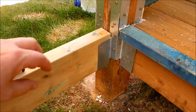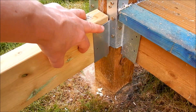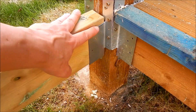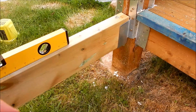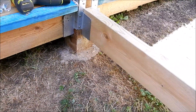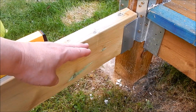You might think five-by-two is a little excessive, but what I really wanted is for it to sit above the holder so I can put timbers across. I didn't want to cut down the brackets, so I went with five-inch height. The cross members — three of them running across between the two five-by-twos — are actually four-by-twos, and they need to be flush at the top.